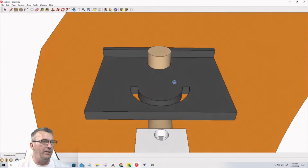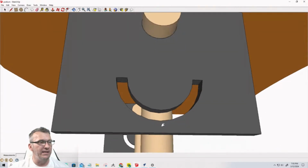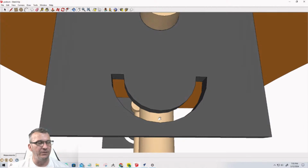What we're going to do here is use 3/4 inch stock, and we're going to be milling away 3/8 of an inch of material. That'll give us a lip that we can screw into the bottom of the tabletop. Then in this dowel, there's going to be a drilled and threaded insert. We'll have a star knob and a 1/4 20 bolt with a washer that goes into that threaded insert, so that gives us the tilting.